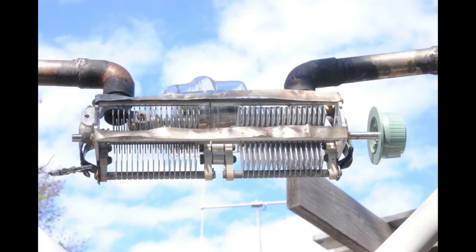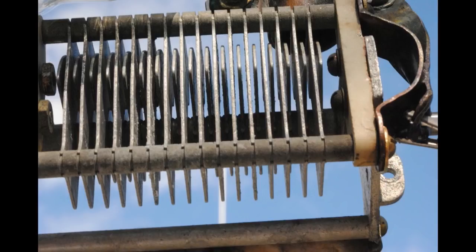This is a 2-section capacitor, and the connections are not to the rotation portion or the rotator. It's to reduce any losses because of the rotating joints. So RF does go through the aluminum, so it's bypassed by copper to reduce the losses. Wow. Well, you've done a great job of that, Jim. And now tell us about the makeup of the capacitor.